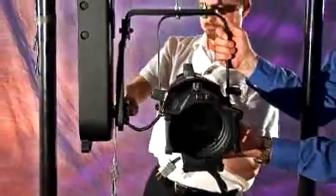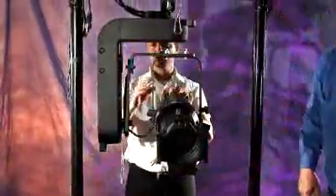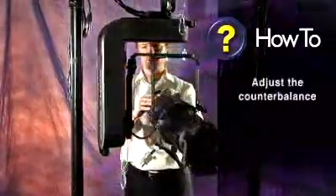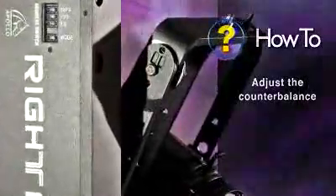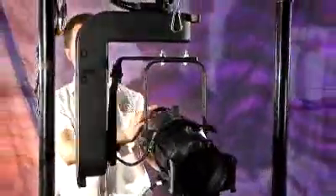Tighten that down. One last feature: if you have a scroller or a front-heavy fixture, you can use the adjustment knob for counterbalance. By loosening that bolt, it allows you to adjust the fixture front to back in conjunction with the yoke to get the counterbalance correct.